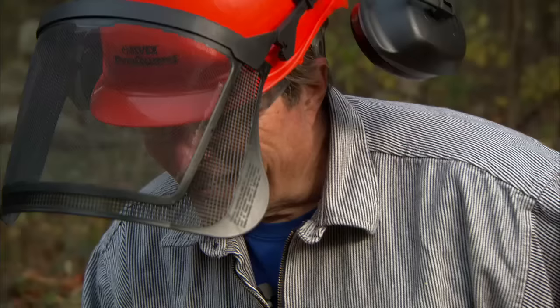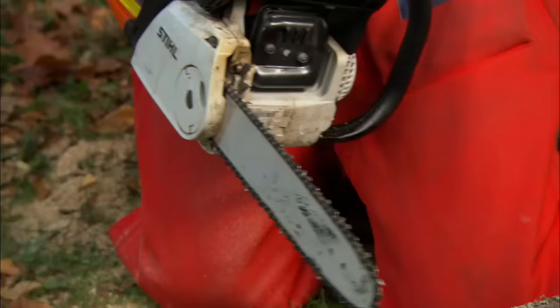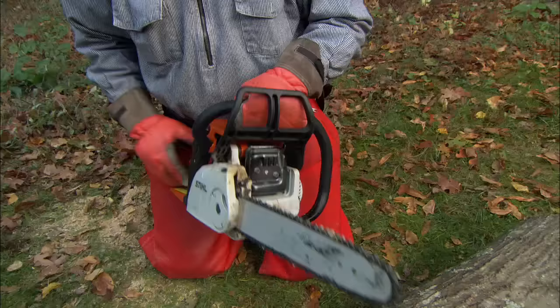Don't forget we have two other reactive forces to contend with. Down here it pulls the chainsaw away from us, and if we have to do an undercut it pushes the chainsaw back. We need to anticipate and understand those forces so they don't overpower us and we can control the chainsaw. Those forces are even worse if the chain's dull, and even tougher the more pressure you add. Thanks for the safety tips and thanks for the firewood. Thank you, Roger.